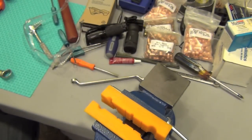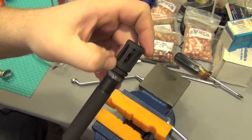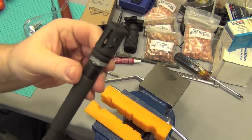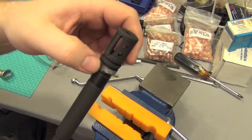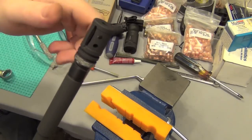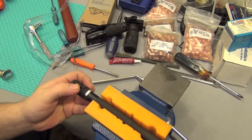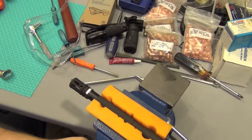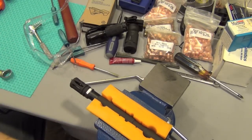There doesn't seem to be any sign of a pin - normally it should be in the flat spot. Let's start cutting. What I'm gonna do is cut a straight line here. I can see the threads down there so I know it was threaded on - it's not machined like this. If it was machined you probably wouldn't have a crush washer. So on the flat side I'm gonna carefully cut along down here and on the other side and see if I can split it in two. Worst case scenario my brother's gotta buy a new barrel - it's a learning process for everybody watching.